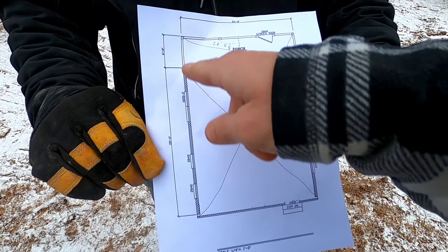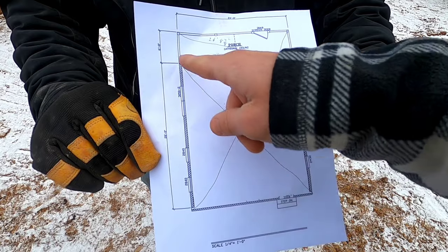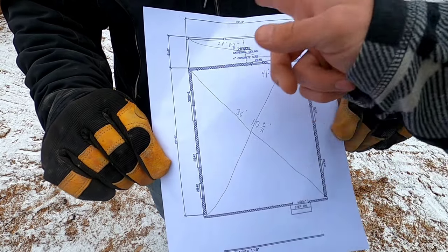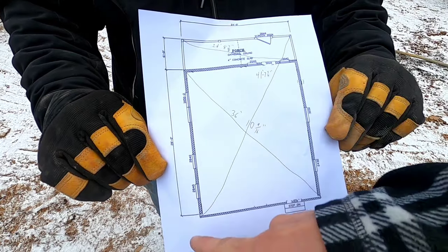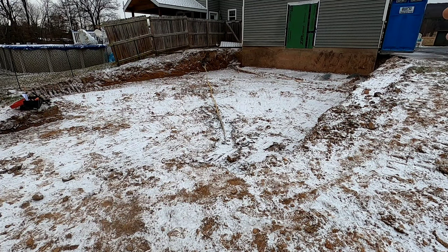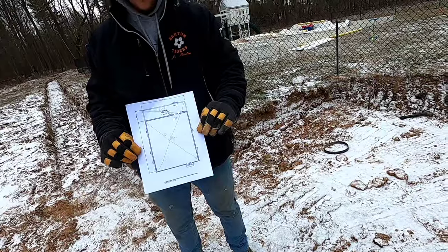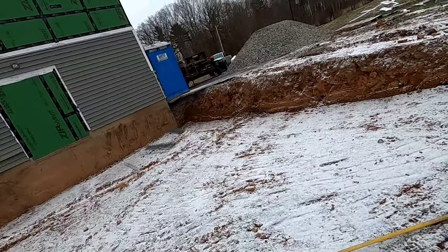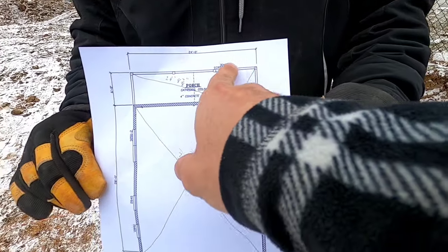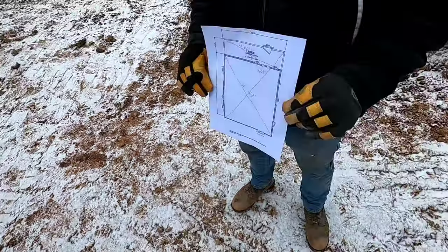I was given this print here: 28 foot and 24 foot three-sided box of 10-inch block, and then a six foot by 24 box for this porch. I got cross measurements for everything, but I think I'm just going to make an entire outside perimeter box to start. The first thing I'm going to do is go 34 foot off — because it's 28 plus 6 — so 34 foot off, I'm going to put a string across this entire back here. I just put this line up right here at 34 feet, that way I don't have to pull two tapes. Lines up: stake, stake — now we can pull our cross.